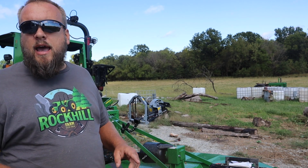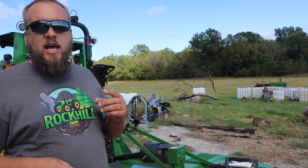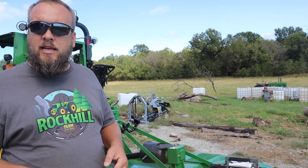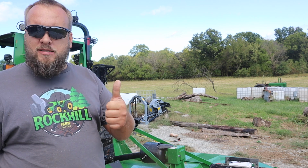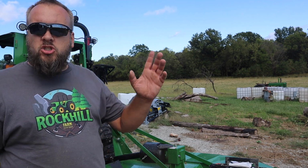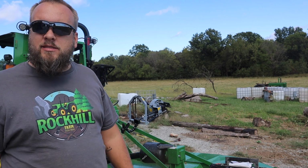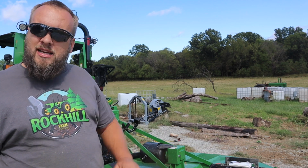on this. And then I'm also going to address the oil in the gearbox, which has water in it. And that might be a good idea to change that oil anyway, but at one point my vent cap got broken. So on the top of the gearbox, that plug didn't have a cap over it, and there was a hole, probably 3/16 diameter hole, just open. And it had a roof over it at that time, but I guarantee there's water in this gearbox, and you can even see it looks milky. So we're gonna address all those things, and hopefully it's helpful to some people out here.